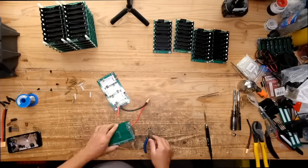But then they're big and chunky and expensive, so it's not ideal to try to use 12 volt equipment on a 24 volt battery, right? It's better if you can match your battery to your equipment. Either replace your battery or replace your equipment to match, so then you can use less electronics and have fewer failure points in your system. So the simpler the systems are, the better, because then there's fewer things to go wrong.